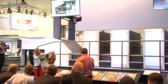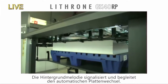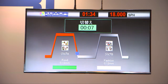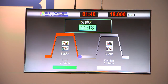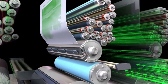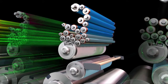The changeover timer on the centre monitor will start as soon as the first job ends. Changeover is being performed now — the ink run-down is being done while the press is decelerating. You can see the computer graphics showing what's taking place inside the press. The AAPC system for simultaneous plate change for all colours will now start. The plates for the first job are ejected, and while the new plates are inserted, the blanket washing and ink presets for the next job are being performed.